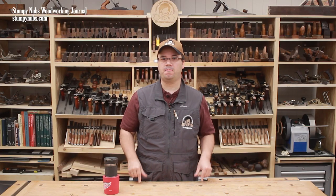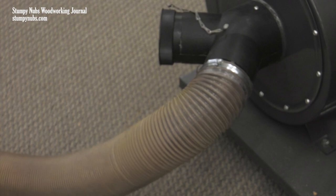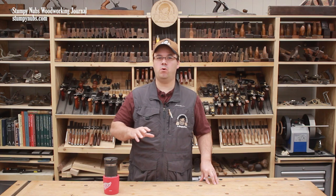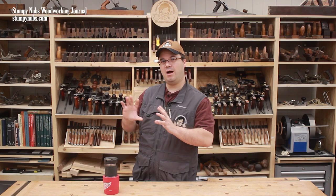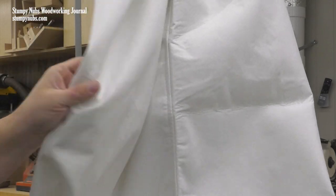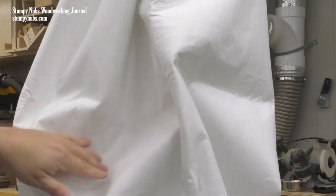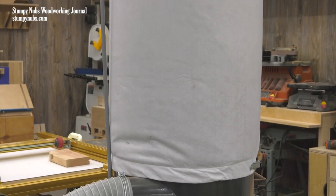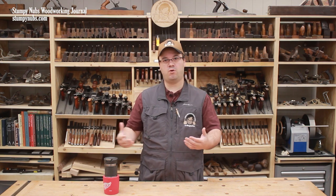First, let's talk filters. Dust collection is all about air flow. The more air the system can pull in, the better it can collect your chips. But in order to pull a lot of air into the system, it must also expel an equal amount of air out through the filters — that is a major bottleneck in these types of systems. Think of the surface of the filter bag as covered in millions of tiny pores that allow the clean air to escape. You can only fit so many pores on a few square feet of cloth, so filter bag manufacturers make those pores larger so they let more air out and increase overall suction. But that also lets more dust out as well.